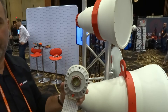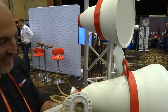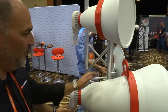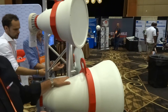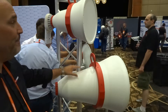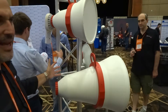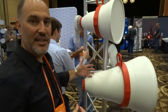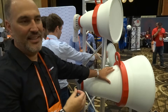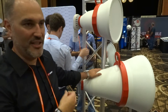So another new product coming out at the end of the year. This is the GPS antenna port — you would connect the GPS antenna down here. Same type of one-handed installation: twist and click and you're good to go. This is the largest model we have right now, the 24 dB version, and this smaller one is a 21 dB version. Looking at the negative-3 dB beam angles, this is roughly an 11-degree beam and this one's roughly about 16 degrees. The front-to-back isolation of these antennas is amazing — front-to-back is over 40 dB. You're going to see 10 to 15, maybe even higher isolation for co-location. So your SNR — the 24 dB version will probably operate and surpass like the traditional 29 or 30 dB parabolic dishes that you're using. Even though we have that lower gain that everybody's worried about, the noise isolation is going to overcome that link budget issue.